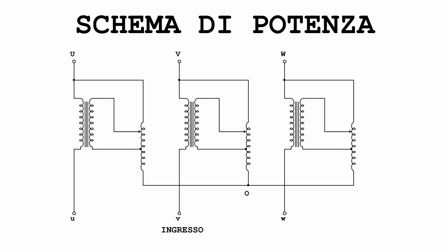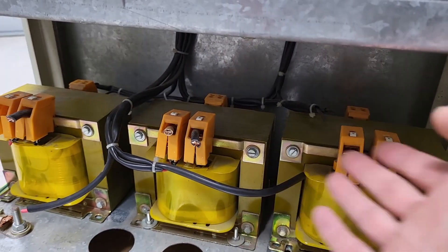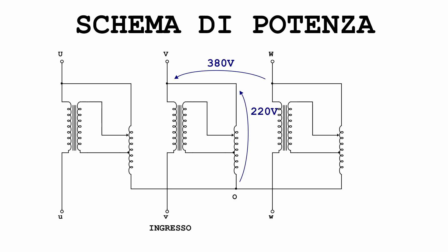The circuit is actually really interesting. Looking at the three-phase input UVW, it goes directly to three single-phase transformers. Each transformer has a winding in series between input and output. The primary winding of each transformer is connected to a variac. The three variacs are wired in a star configuration between the three phases UVW and a central zero point. Taking the center as reference, you can see the particular connection of the transformer with the variac — one side of the primary winding connects to the center tap of the variac, and the other side connects to the variac slider.